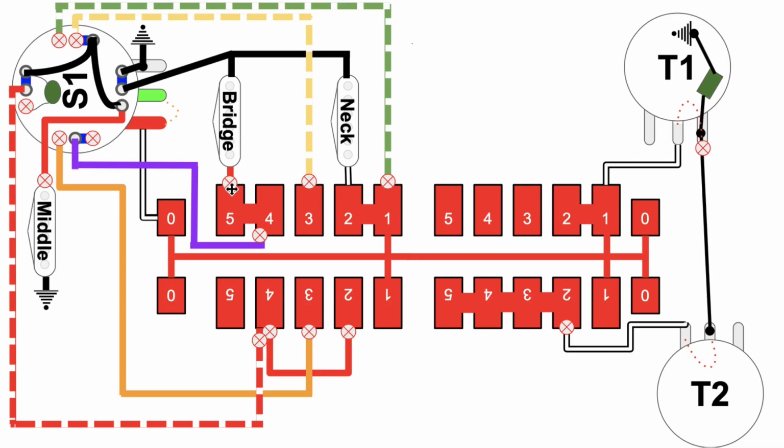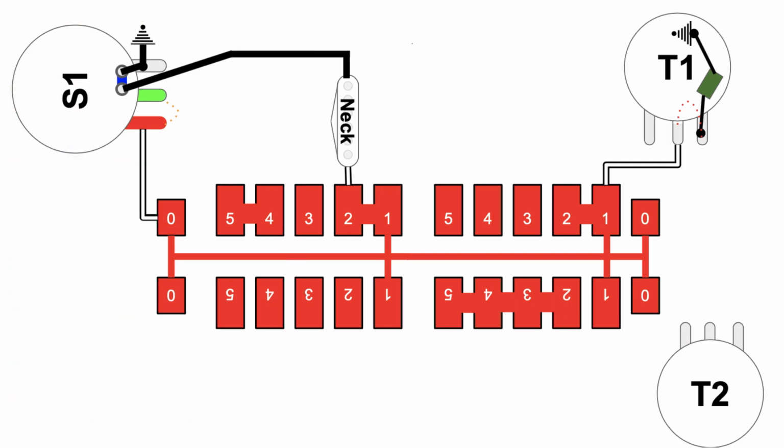So when I put these red X's in, it means that those particular connections, those parts of the circuit, are out of circuit. They're simply out of circuit at whatever configuration we're using at that time. They could be out of circuit because of where the Super Switch is, or because of where the S1 button is. But either way, they're out of circuit. For each setting, you're going to see these little X's, and then the next slide is going to show what I do with that. If they're X'd out in this slide, then I can completely take them out in the next slide to simplify the explanation of what's happening at this particular configuration.